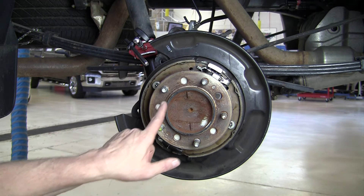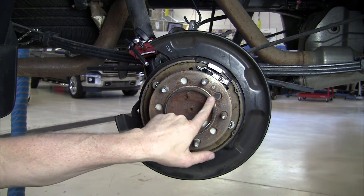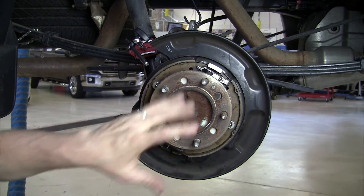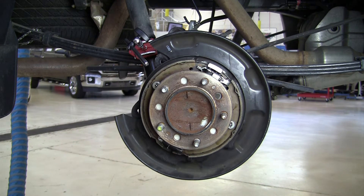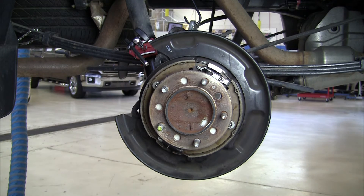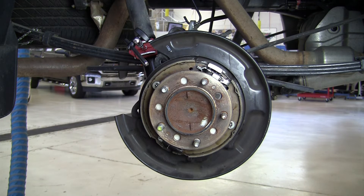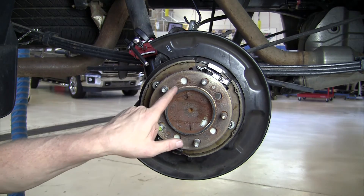This is a demonstration of measuring the axle hub runout on a vehicle. This round hub is what centers the wheels — at least the factory wheels on most vehicles — and if it is wobbling up and down as it's rotating while you drive down the road, that can lead to a first-order tire speed related vibration. A first-order vibration creates one shake or one disturbance per revolution of that part, so a first-order tire speed related vibration creates one shake per revolution.